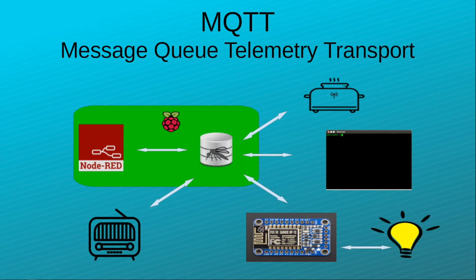Because I use MQTT to send the messages, weather, temperature, on, off, and because MQTT allows multiple subscribers and publishers, I can manually or programmatically use the information in other ways, such as shell scripts or smart home software, which I do have Home Assistant, later on I will show a little bit about. Okay, I currently use Samsung's SmartThings with my Node-RED flows. I use shell scripts, I use Python scripts, and I use Home Assistant, which I only just started with, and it's driving me a little nuts, but I can turn things on and off with Home Assistant. Right, and this is what I'm using in my home.